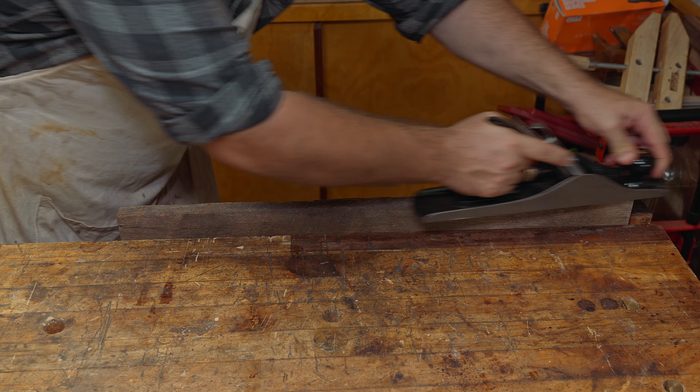Now if you've got a damaged board that's actually pulling apart it's going to be a little hard to tell down that end, so I'm going to discount that section when I'm squaring because that's where I'm going to chop it off. Normally you would already have your boards chopped rough to length so you've removed the bad parts. If we look at this board here we can see that it's not square — we're high on this side and low on this side.